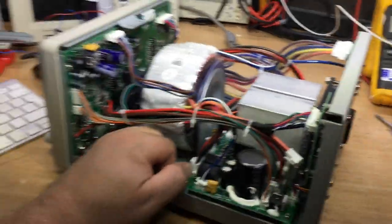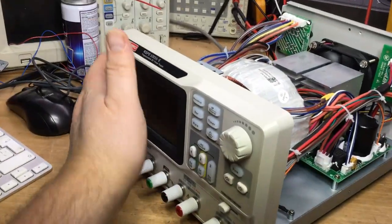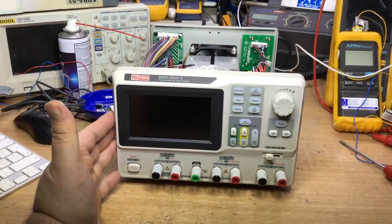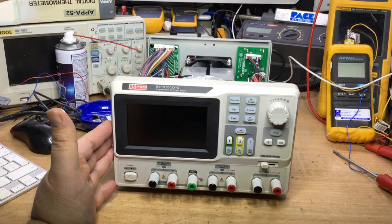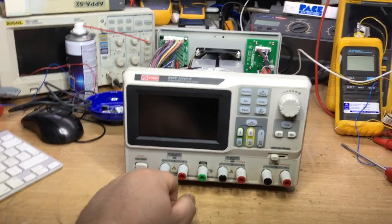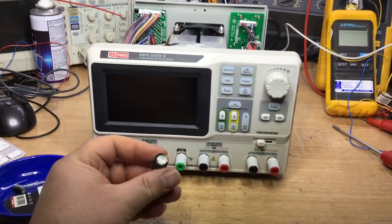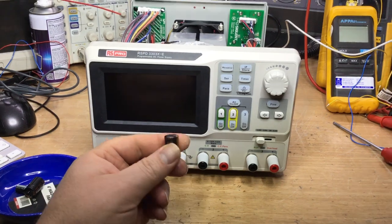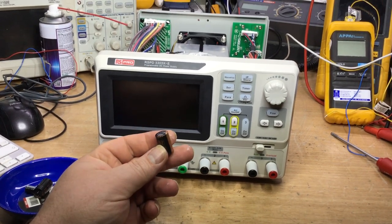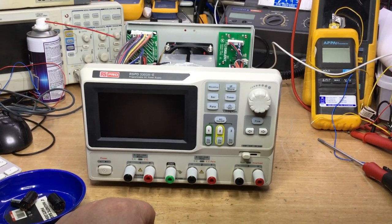Normally they go fizz bang and release the magic smoke and go into a black charred mess, but this one didn't, and we'll live and learn with that one. I think this repair's definitely had a few tricks up its sleeve, as this power supply. We've gone from one extreme to the other. We thought that the reservoir capacitors that were originally in the device were faulty, which they were, but it's due to them being cooked by the overheating bridge rectifier for years on end, being warmed up next to them.